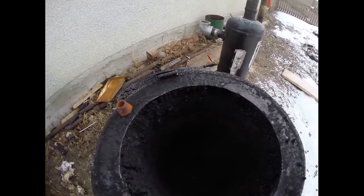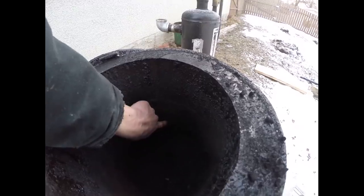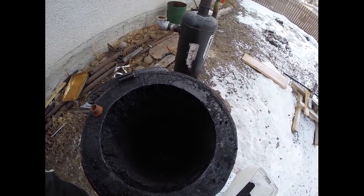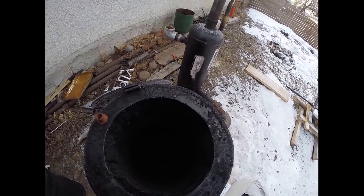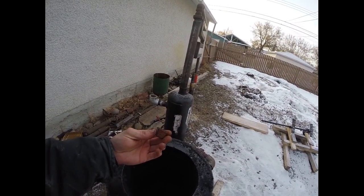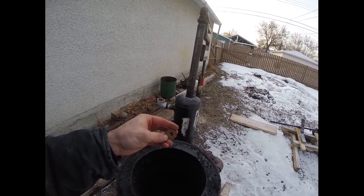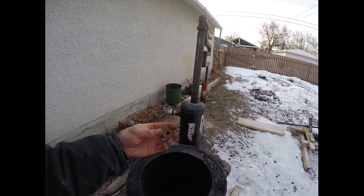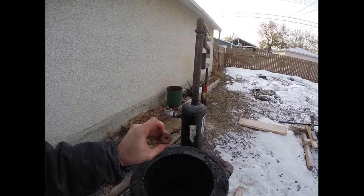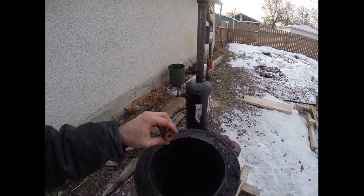These are air nozzles on the inside. Right now I want to run a smaller engine, so I have five of my air ports plugged off and five are open. For these air ports I use a three-quarter inch plug — they come with the hole already in it, or you can buy plain plugs and drill them out. I found three-eighths inch is about a good size for your air nozzle, and they're super cheap and available anywhere.